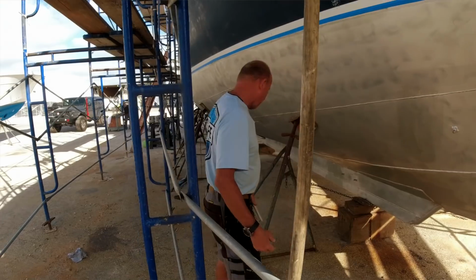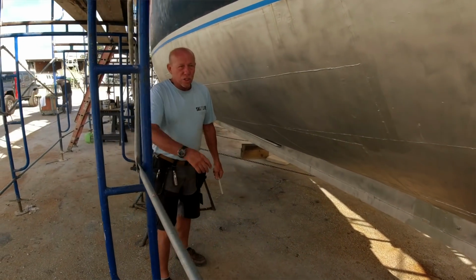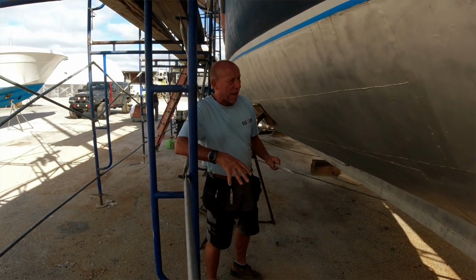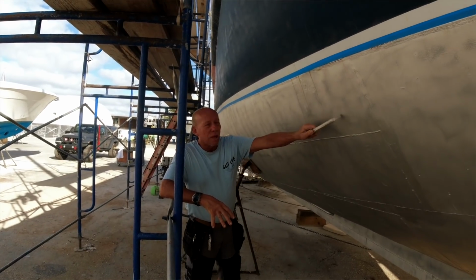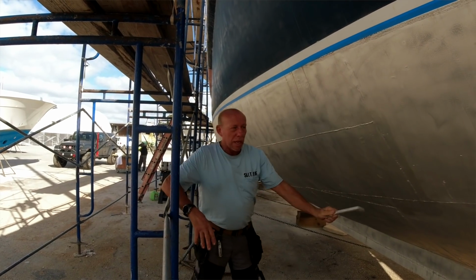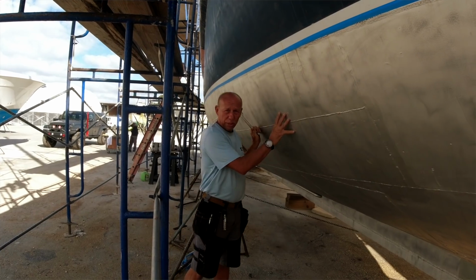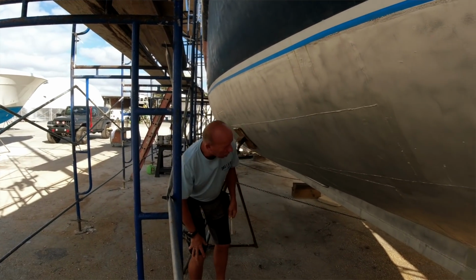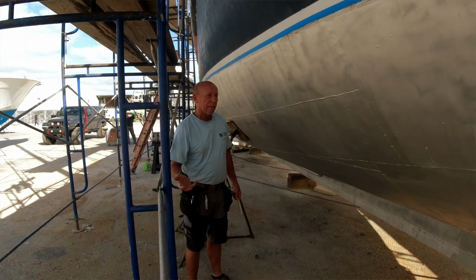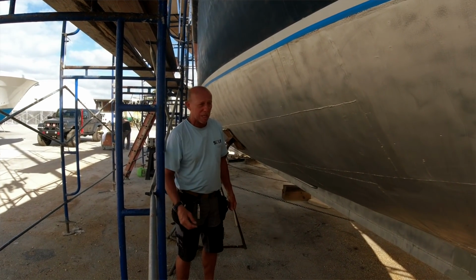So walking along the boat, there are certain locations in the boat that are actually a tank inside. And what I mean by that is we have the hull thickness, we have the ribs, and in certain locations, the complete hull of the boat is the tank. These areas are where in some places the plates were replaced, so we had to come back and modify those locations because that was not made with the high chromium steel.